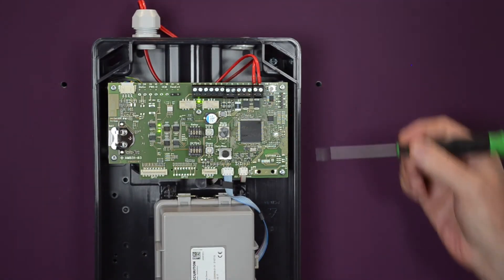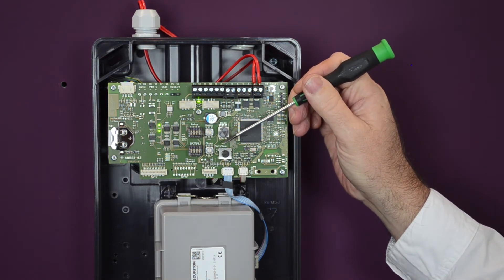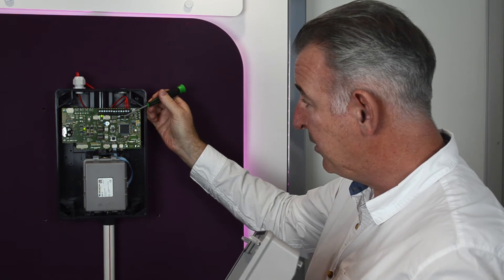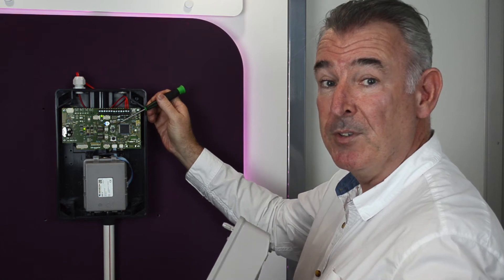With the easy config, it's a matter of first setting up the class of sensitivity of the holes to be used. We have an option of A, B, or C class holes. Then we move on to setting the number of holes on the piping network, which in this case is three, so we set the rotating switch to three. Then we move on to the last step of the process, which is initializing the airflow.